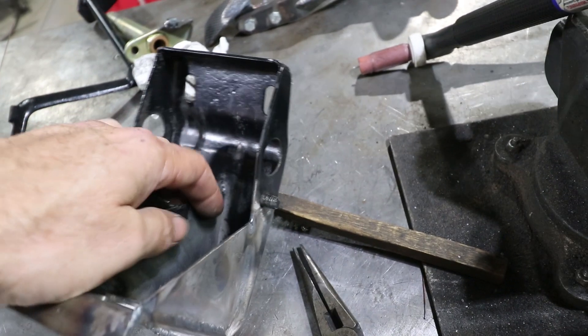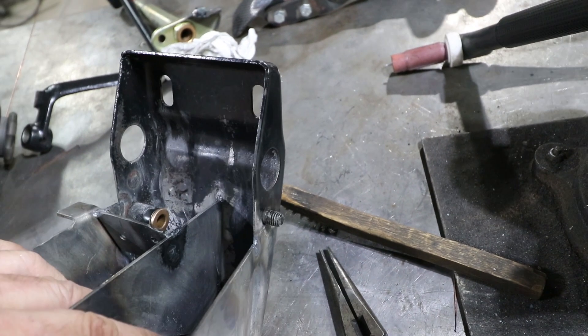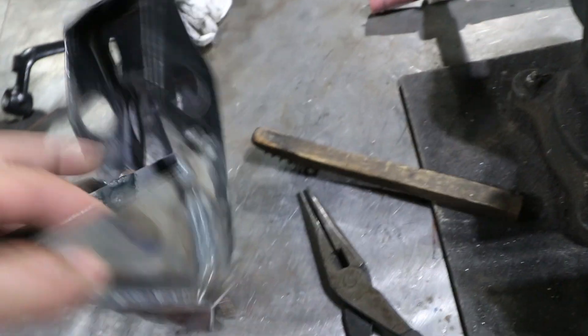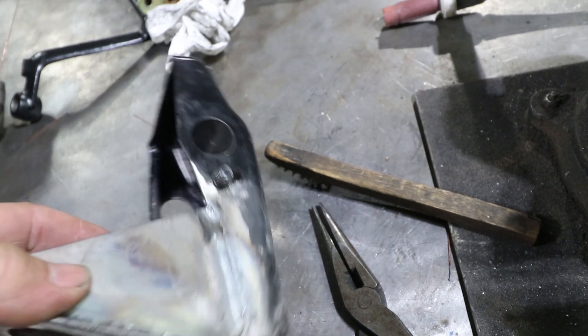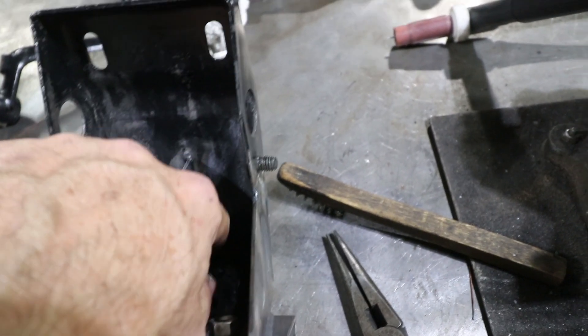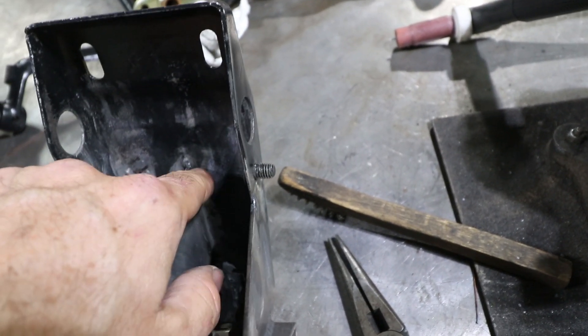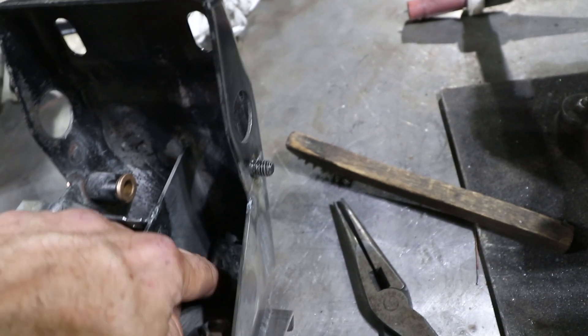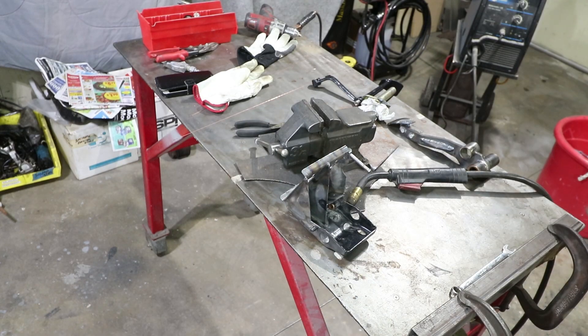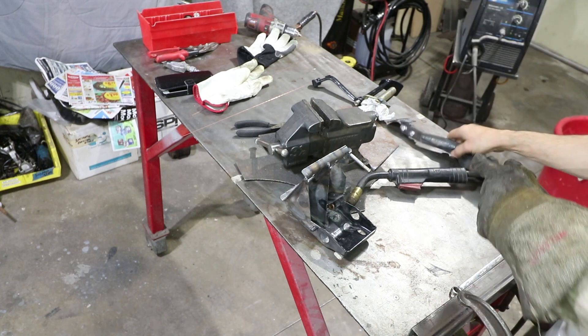That's a pretty important brace right there because any of the forces that go into the master cylinders is going to be pulling on the base right here. It's welded on the edges, but the third plate in there is for extra stiffness. I feel better if it's welded at least an inch and a half along the bottom, maybe even along the back. I'm fully suited up here for old Sparky — let's give it a try.